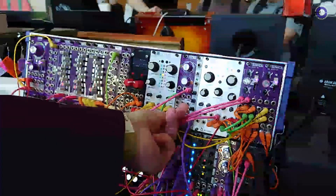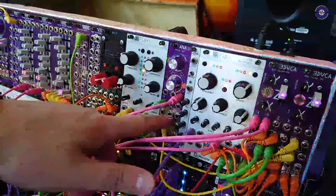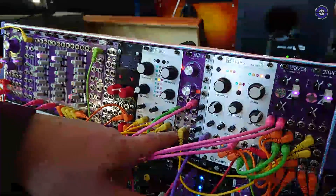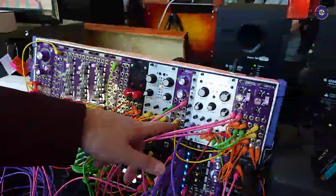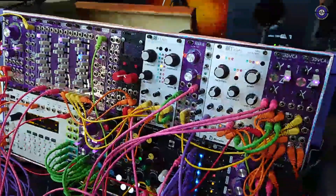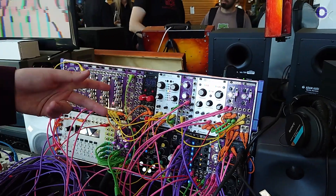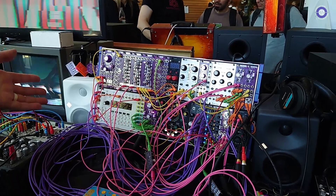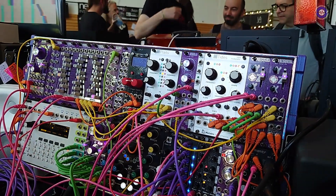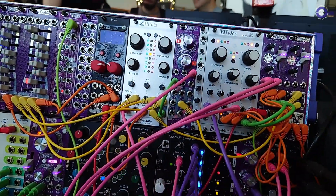We've added three new outputs. Now you have the minimum and maximum, which is pretty standard for analog logic modules. There's also a mix, which means you can use it as an attenuvert offset. There's the analog XOR, which behaves kind of like a through-zero VCA but uses clamping instead of attenuation. There's a new cut output — it's a very bizarre nonlinear wave shaper. The magnitude output gives you the difference of the two, which always gives you a positive voltage. We've enhanced the step output, which is a track and hold similar to the Wogglebug pseudo-random generators, and it samples both inputs while using the actual signals to generate the clocking behavior. The clocks come out of the box output, which gives you a three-level square wave with positive, zero, and negative — so you can pulse width modulate the positive and negative sections separately. And there's also a swap output, which is basically a switch that switches on or off the different inputs.